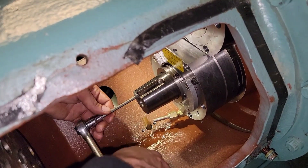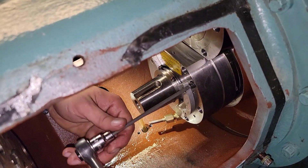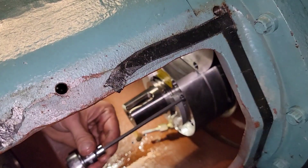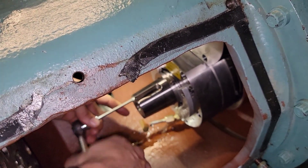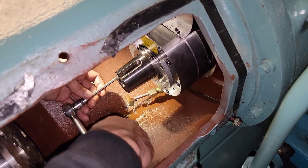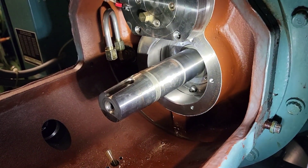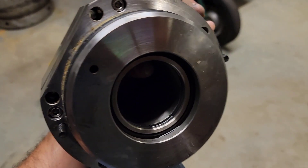It was on there well — it wasn't just pulling straight off. Thankfully these do have jacking bolts, so right now we're going back and forth, nice and easy. You can see we've got good body separation in the back and we'll slowly back that seal off. It should be just about to the point where it'll start to pull off by hand. And there she is without the shaft seal in — we're getting everything cleaned up.